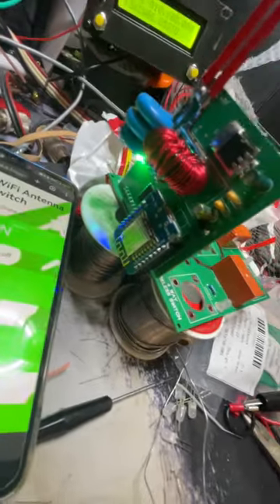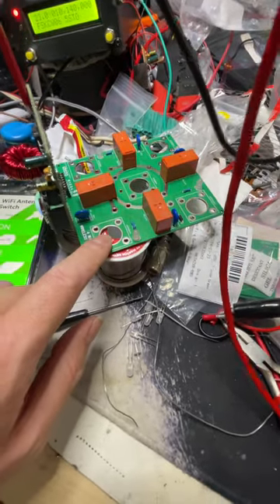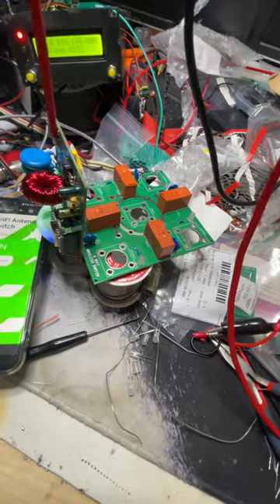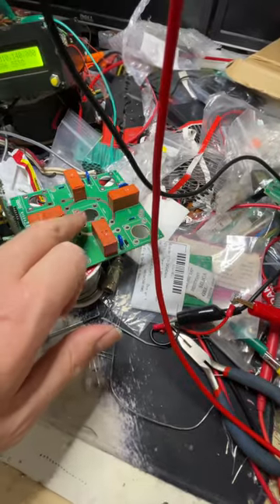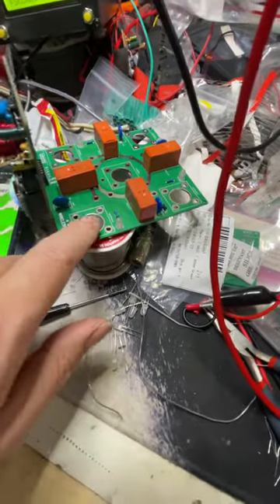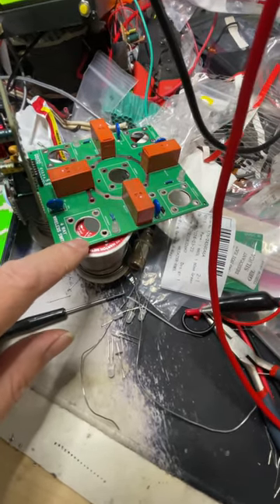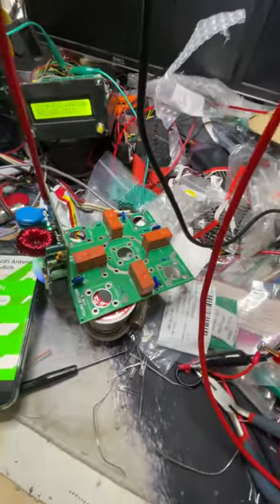That's it in a nutshell — bias is good. I'm going to try to get the connectors in, test for 50 ohm loads, and put this into a VNA to see what we're getting out — making sure we're presenting a good 50 ohm load. The common port comes in here and each one of these will be the antennas going out. I'll stick an antenna socket here and a dummy load on port four, for example, and just verify we're getting a good 50 ohm load.